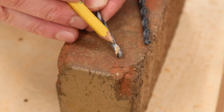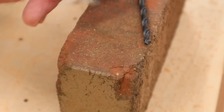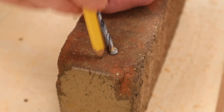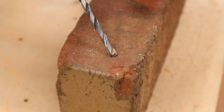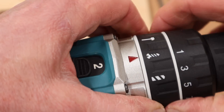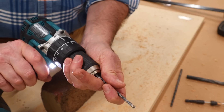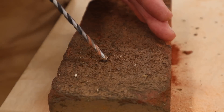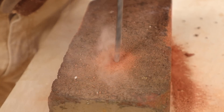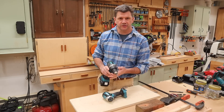Here's a look at the masonry bit — it's kind of like a regular drill bit but with a chisel-like head at the top. A regular drill bit will go through metal, plastic, and wood, whereas the masonry bit is designed specifically for masonry. When you drill with this bit you use your drill on the hammer setting, which spins the bit and hammers at the same time. With the drill in the hammer setting you'll notice it's noticeably louder.